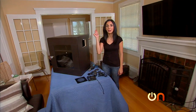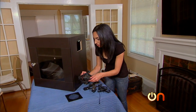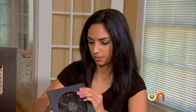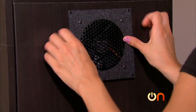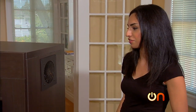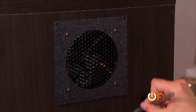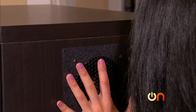Before we can finish the installation, we've got to do a little cleaning. Much better. Now we can get to installing the fan. The first thing we need to do is secure the fan to this mounting plate — fit this in here, that looks really nice. Lastly, we'll put four wood screws in to hold it in place. To make it easier, I'm going to drill four starter holes and then hand-screw in those screws, so I'll mark the middle point of each.